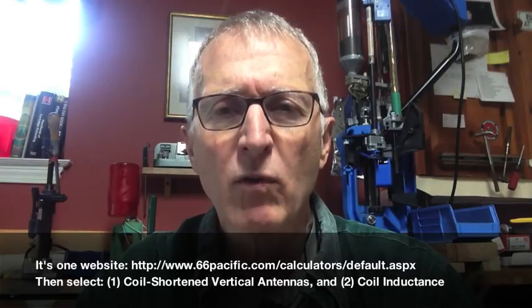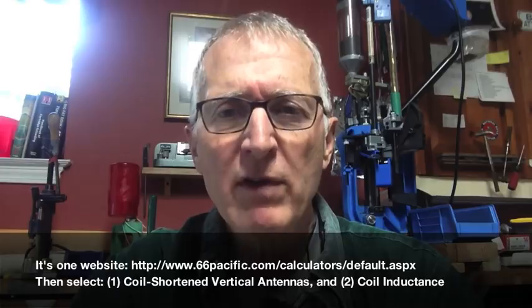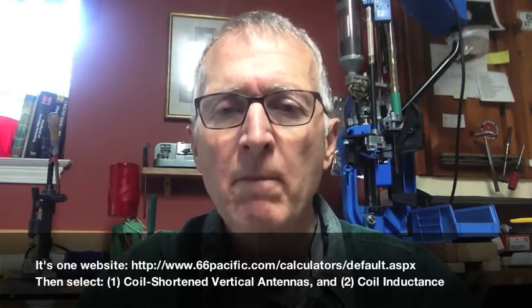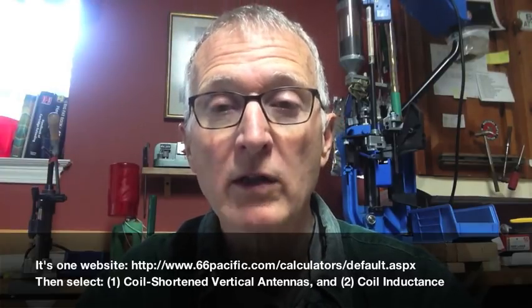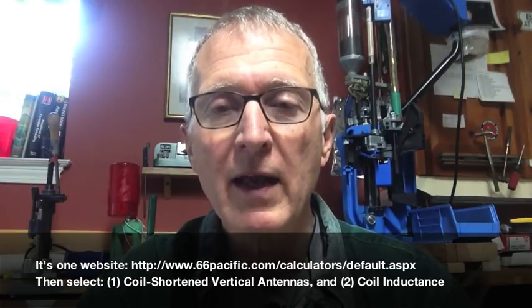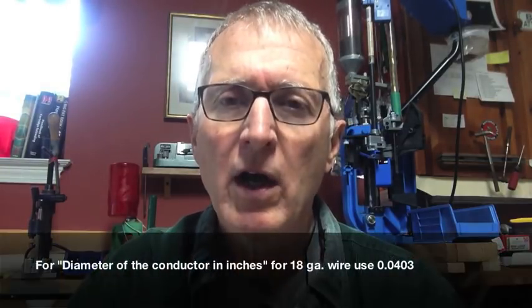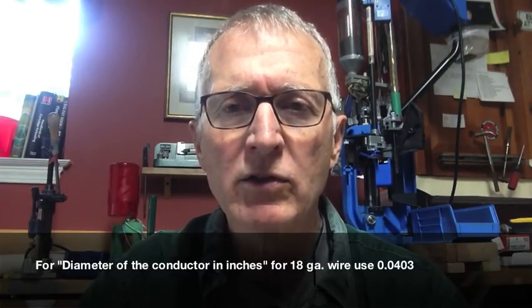I'm going to give you a couple of links to websites on coil design. Every variable I've shown you can have different specifications to meet your needs. This particular antenna works as described — if you just want to build what I built, it will work. But if you want to experiment with other frequencies or dimensions, those websites will help. That is the No Stick Buddy Stick, and I've had great success with it. I marvel at how well it performs both sending and receiving, and I use it almost exclusively now in my Summits on the Air activations. I hope this video has been helpful and I wish you great success.